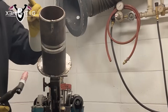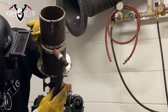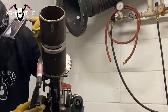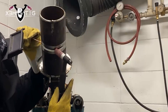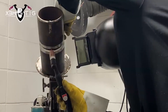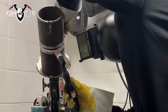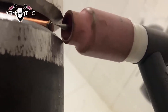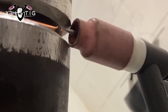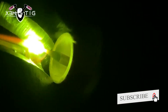Above that edge — as you can see, the filler rod is going to be above that edge. You can look through the gap from the top, or just position yourself on the side. You can feed from the top like a back feed, or just place that filler rod more horizontally. For the other side, if you don't use your left hand, you can do it the same way. Free hand or walk the cup, whatever works better for you. You can even use a smaller nozzle that'll fit inside that bevel, so it'll be easier to wiggle the cup inside the bevel.